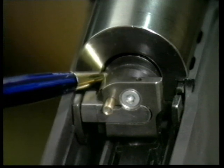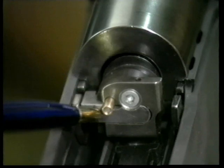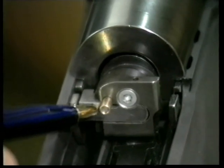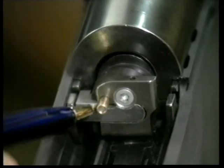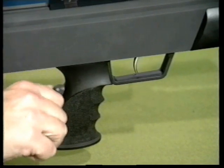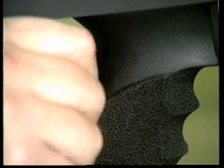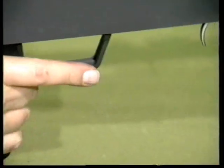In this position, the bolt is lowered down in such a way that the firing pin cannot reach the primer of the cartridge anymore. After moving the grip safety downward, the shooter can either push the bolt forward to the loading position or to the rear for unloading the cartridge.